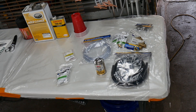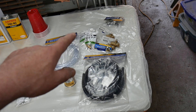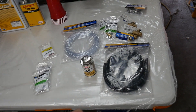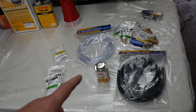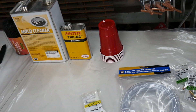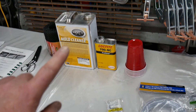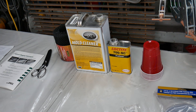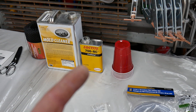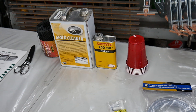The first step is to go to the hardware store and buy all kinds of stuff. I'm going to go over it in detail. We've got ball valves, various plastic T's, some spiral wrap - couldn't quite get the right size but I have the right size coming for the larger molds. A quarter inch vinyl tube, some ABS cement. Then we've got the ubiquitous Canadian beer cup - I'll show you what those are used for. Mold cleaner from Rexco - I got all this at Composite Envisions, I'll throw a link in the description. Loctite 700 NC is a chemical mold release agent, so no wax - we're going to use this chemical mold release agent.